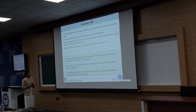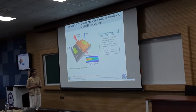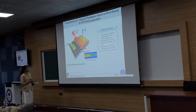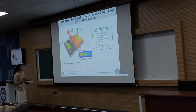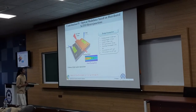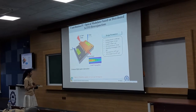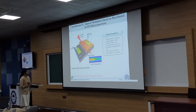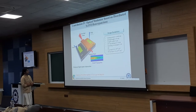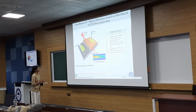To overcome this, in our next contribution we have seen optical modulation based on distributed silicon-ITO heterojunctions. These are the distributed silicon-ITO heterojunctions with grating period of 600 nm, grating height of 130 nm, and ITO on the top of 50 nm.